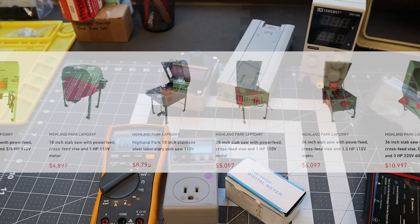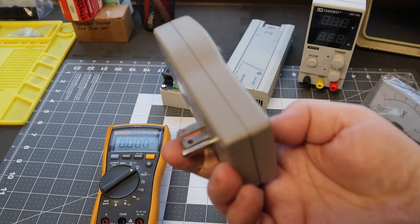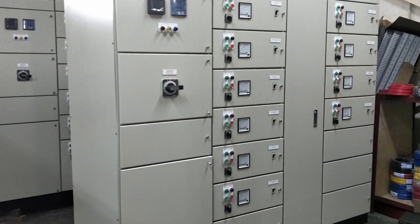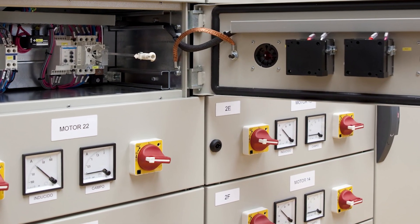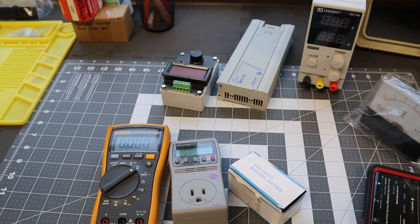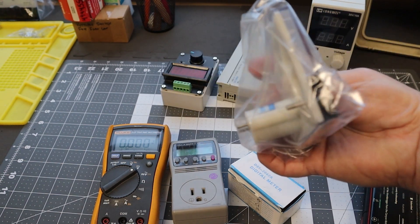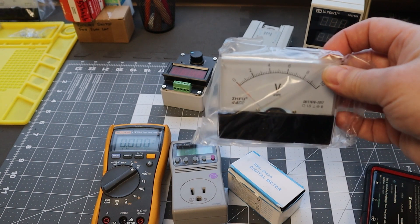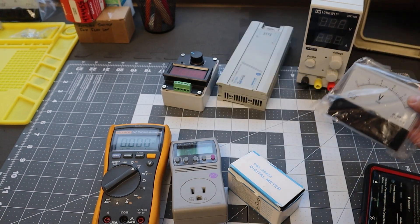So that's the question. Now there are products where you could easily check that — here's a Kill-a-Watt — and you're able to see what the circuit is doing, see how much it's drawing, and that's really the telltale sign. A bunch of us responded that yeah, we've seen that on equipment. In fact, I recall seeing it on equipment in a truss plant north of Spokane — older equipment — and the motors there to cut different kinds of stock had panel mount meters on the electrical equipment, kind of like this. I don't have one for amps; this here is a voltage one, but it was a panel mount meter.